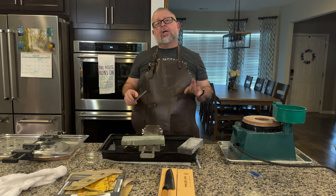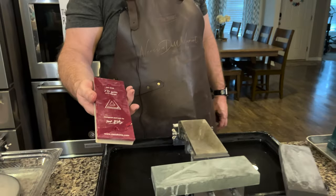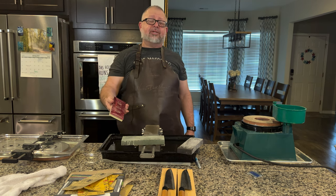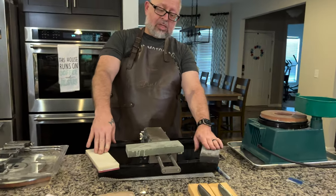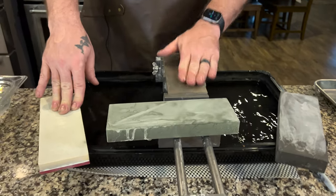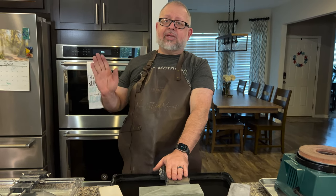I was able to do this with stone, so let me talk about how we're going to do it on the show. I have a lot of different stones out. We have a 200-grit Nano Hone — very aggressive. My suggestion is if you're going to use a 200-grit, you need to be very experienced because it's super aggressive and it's going to remove metal very fast — you can get uneven spots very fast. I have a 500-grit Morihei. I also have an 800 CBN, and one of the things I like about the CBN is the metal plate that the CBN is electroplated to is flat.